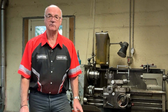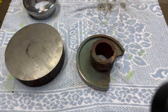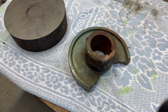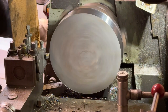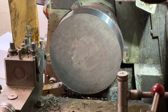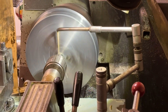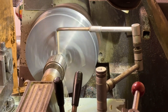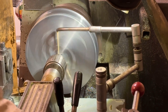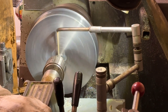As you can see, this pulley has had a little bit of wear and tear in the past. This is quite a big piece of steel — it's approximately 260mm diameter at the moment. I'll be machining it down to somewhere in the region of 245 to 250mm, first of all, once I've cleaned up the face and the edge.